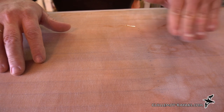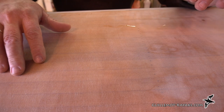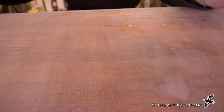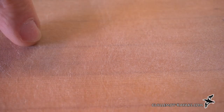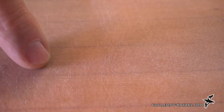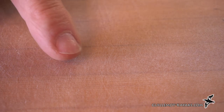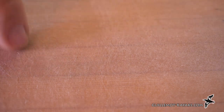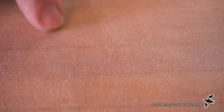And as I'm sanding, I've sanded through the second fill coat down to the original fill coat. And if we look closer over here, we can see these long scratches. That's the 60 grit sandpaper. I had the sander in the aggressive mode, so with the geared head, it spins the whole head under power, and you get these long sweeping scratches.